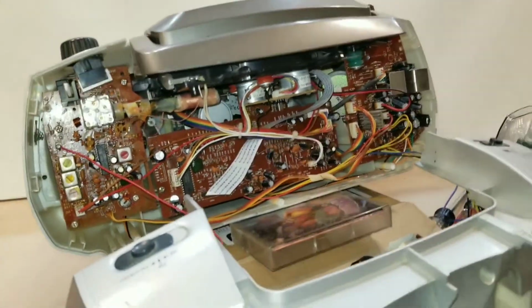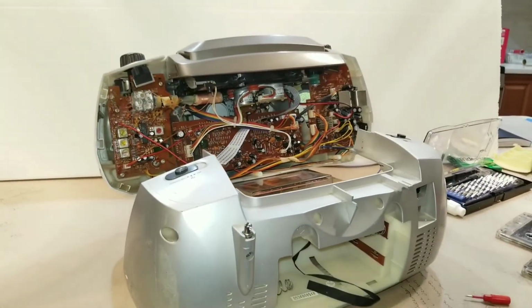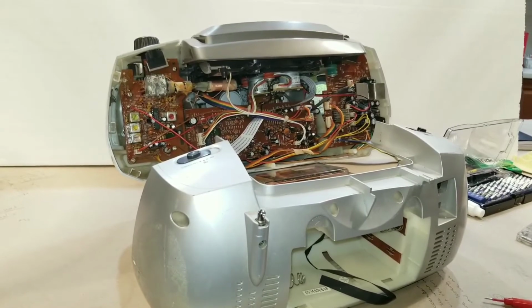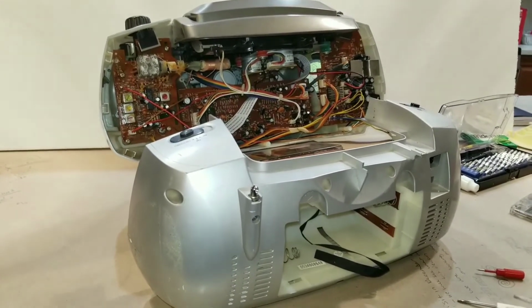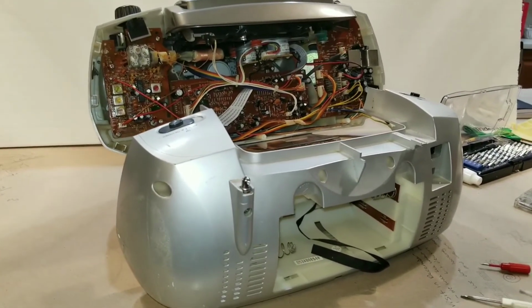And another thing, before I get into this, if you're trying to do this to your radio, remember, some radios have a hole in front of the radio that you could slide a screwdriver into and actually adjust the speed without taking apart the radio. Some of them actually do have this. This one doesn't, so we had to do this, but be on the lookout for that.